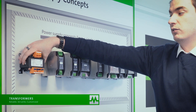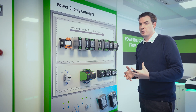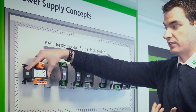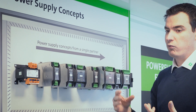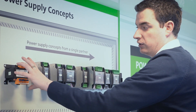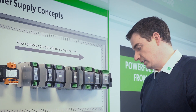We also have electronic transformers. These are not the cheapest of the cheap — they are completely flexible and bespoke to your needs. If you give us the specifications required, we can build a transformer for you. We also have very high accuracy on VA, so that rather than building in a standard 10% contingency, if you specify as close to 100% as possible, you will make the unit more efficient. With a transformer, the magnetization fights itself when it's not at optimal range.